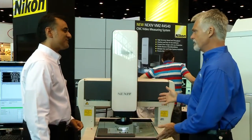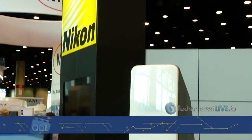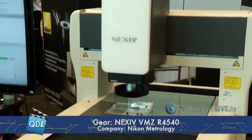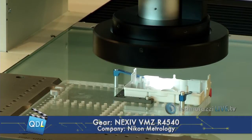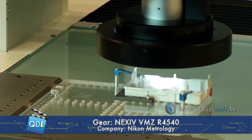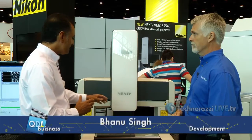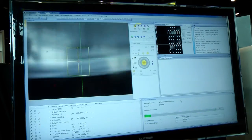What makes this different from your previous machine? This is higher accuracy, and a lot of that comes from the linear encoders. That technology is coming over from our precision department, which makes the stepper scanners for the semiconductor business. So we're incorporating that high-precision technology — higher-end components, a stronger, more capable laser. The software has been revamped and updated with a lot of 3D graphics.